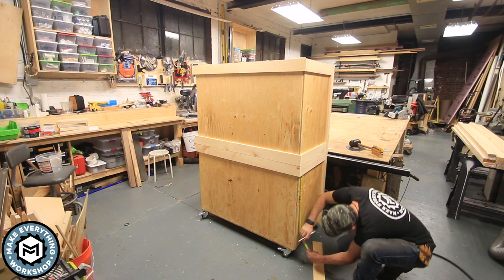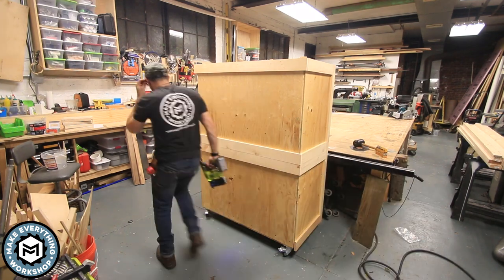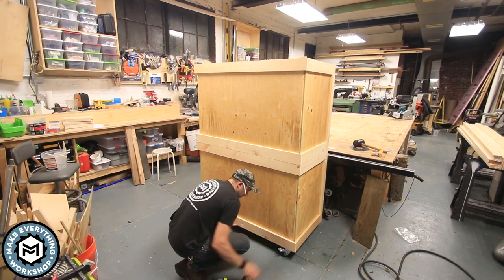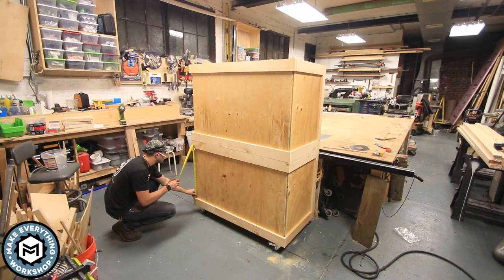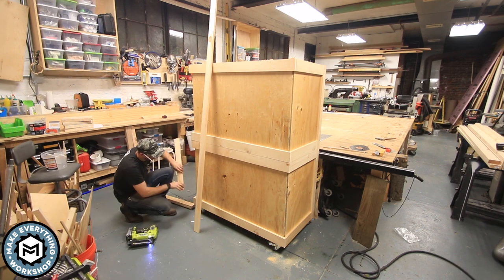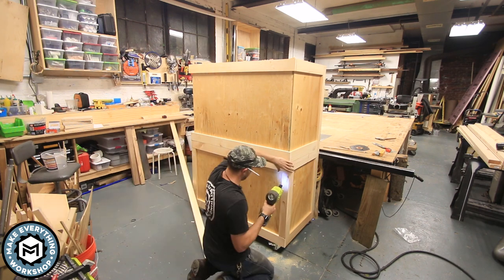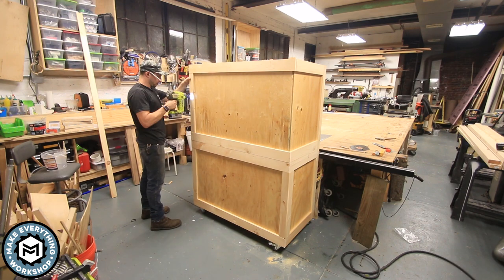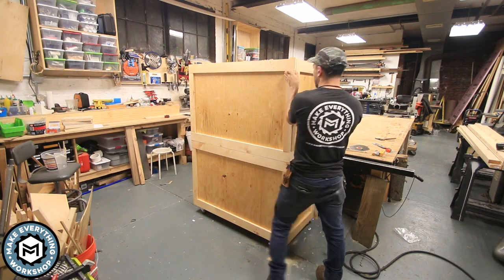To attach this, I'm using inch-and-a-quarter 18-gauge brad nails and I'm not using any glue. The reason is because these things tend to change — the requirements or dimensions might change and I didn't want to lock myself in by gluing all this stuff down, and then potentially have the client say we need to make a quick change. The inch-and-a-quarter brads have a nice amount of grab — I actually tried to pull a piece off and couldn't get it off — so I'm not worried about these going anywhere. The corner blocks are the one-by-three material, and this just frames everything in really nicely.